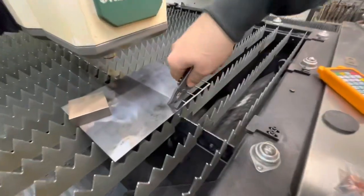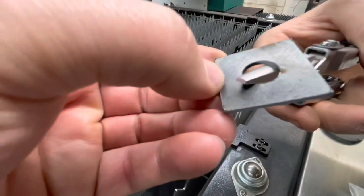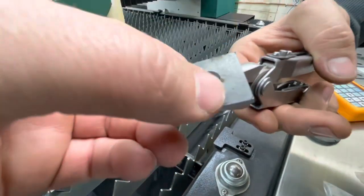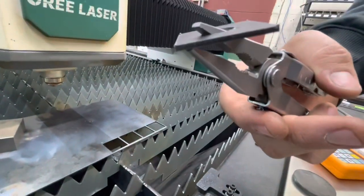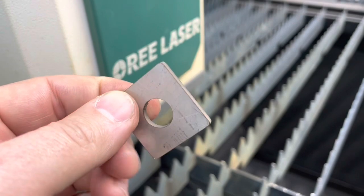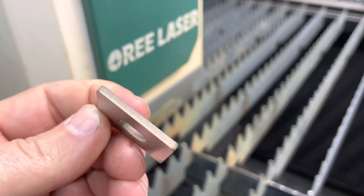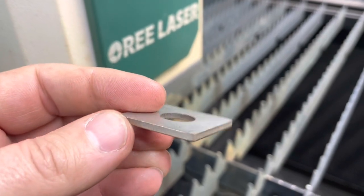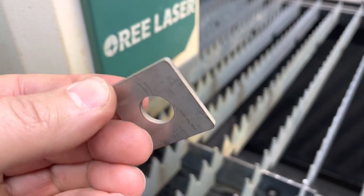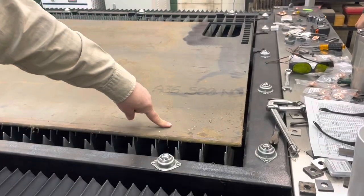This is 14 gauge on compressed air, and it's a pretty nice cut, but you can see it's got just a very slight burr on it. This I think was 11 gauge on stainless — this is the one that Jonah and I are pretty proud of. We had maybe an hour or two into this one trying all kinds of stuff, chasing after a little tiny burr and had some difficulties, but got it going.